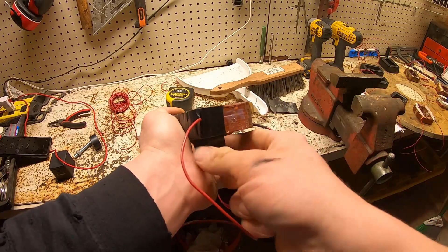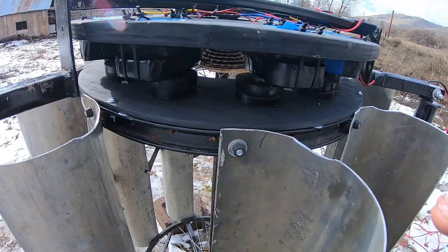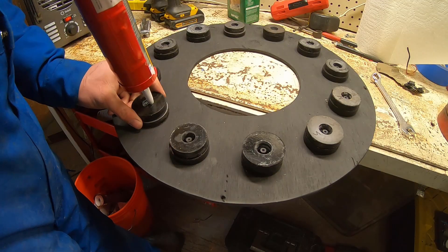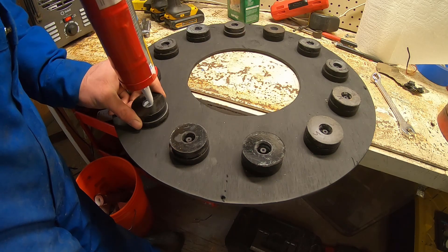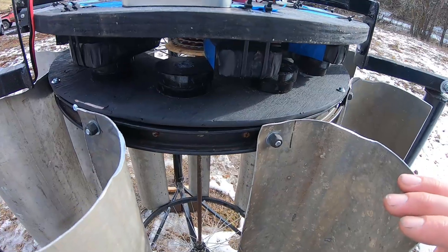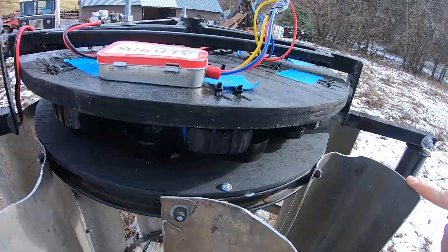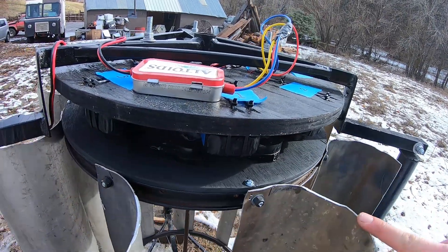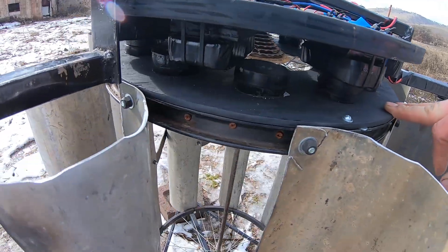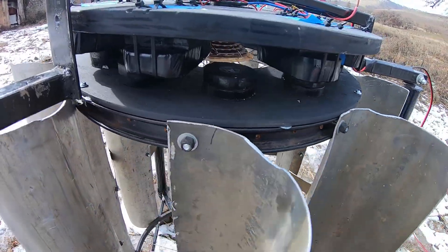I'm coming in after to say this, but I forgot to mention it: these magnets under here are oriented north-south, north-south, north-south, and what that does is it creates our AC sine waves that can be rectified — you're pushing the electrons in either direction, back and forth. Because gravity is holding the magnets down, all I really need to worry about is side-to-side motion and making sure they're going to last if something gets in between. They need to be durable enough to take a little bit of abuse. Basically, this was the quickest, easiest, and cheapest way I could think of to mount these.